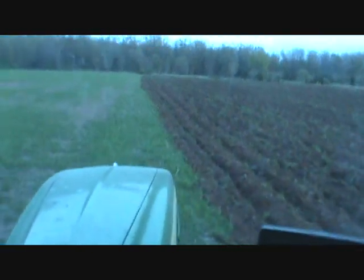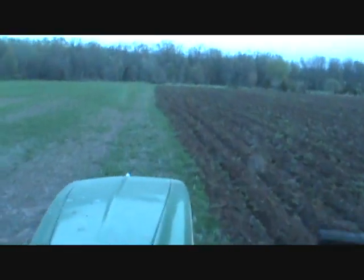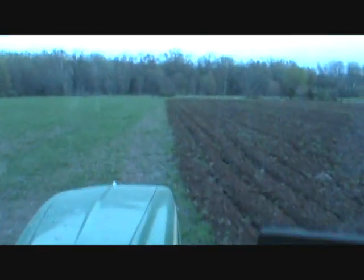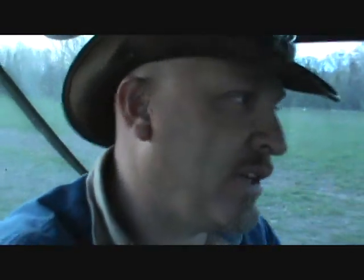It's officially spring when you break out the tractor and the chisel plow. I'm running a 12-foot chisel plow with this 81-20 going very deep. This ground hasn't been plowed in a long time, probably about 10 years. We've only either no-tilled it or just run the disc harrow over it. A disc harrow only cuts in maybe 8 to 10 inches — whatever a 22- or 24-inch disc blade will cut. So I decided this year I'm going to run the chisel plow on this field.